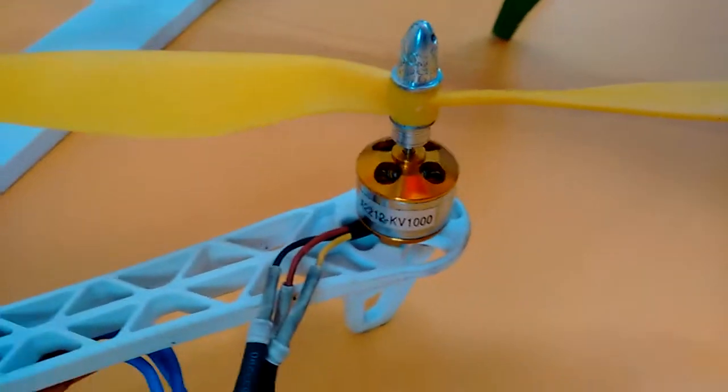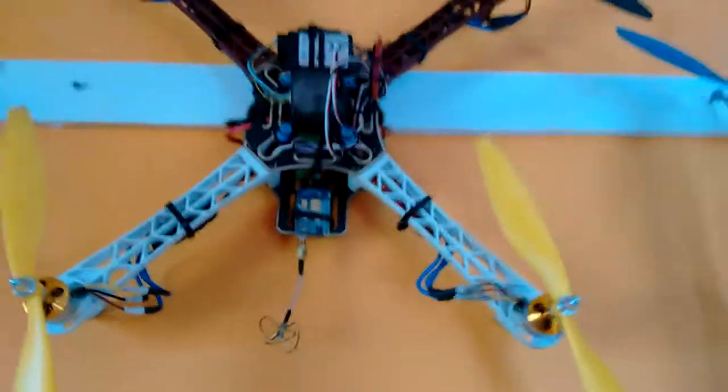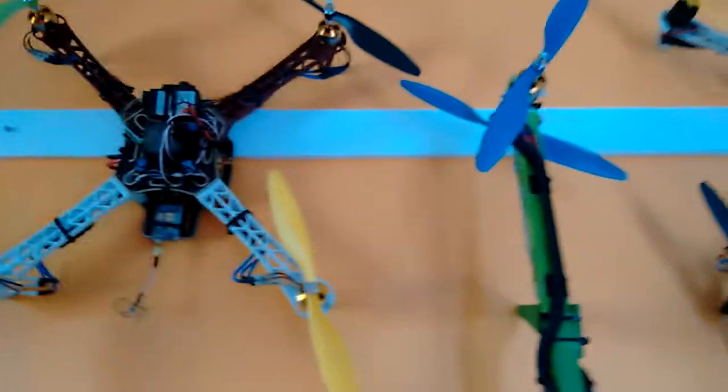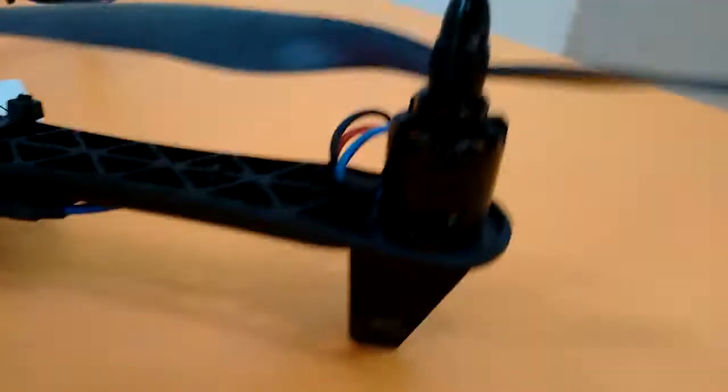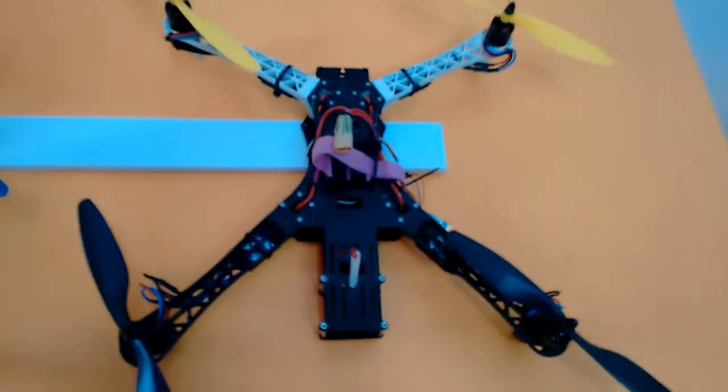And I'll actually zoom up on the motor itself. There you go. They're using the same FunSky ESCs. So is this guy, once again FunSky ESCs, but the first difference to note, like I said, was the SunnySky motors. These are the SunnySky, I don't know whether that's going to actually zoom in, not enough light. 2212s again, I believe they're 980 kV.